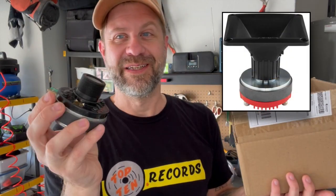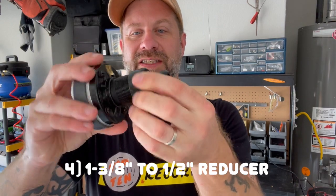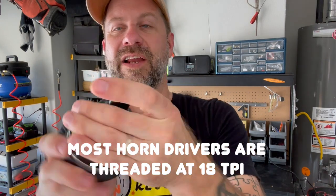The next thing you need is the actual speaker that goes inside the talk box. This is a five-core horn driver — I'm not saying it's the perfect one, this is my first time doing this. It's very simple and self-contained, like the driver off the back of a PA horn speaker. This one is eight ohms with a 20-watt power rating. This little reducer is probably the most important part — it fits perfectly on the horn, threads right on, and on the other end has the half-inch OD fitting for the tube.